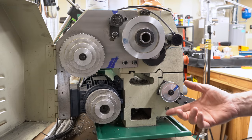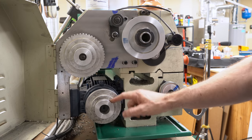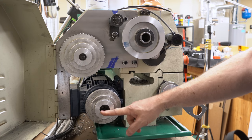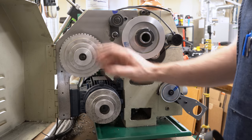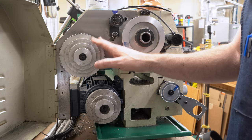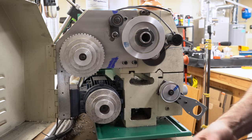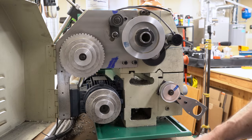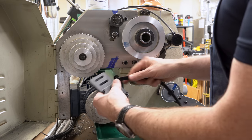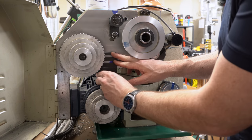This is the end of the lathe — yes, it is dark back here and terribly difficult to get enough light in, but we'll make do. This is the main three-phase drive motor with a three-step pulley, and the same three pulleys up here on the spindle, so the belt to drive the spindle goes up here. You can also run the belt up to the back gear using a cog belt behind it — a timing belt that gives you more mechanical advantage. I'd really like to preserve the usage of that, but I haven't used it since I put the ELS or VFD on the lathe.